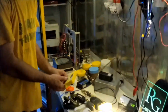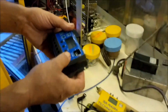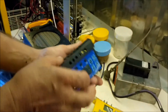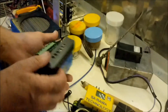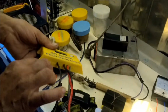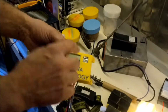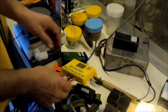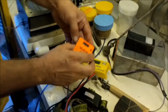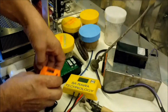One problem here is that the humidity destroys electronics, and there's thousands of little ants that get into them through the tiniest openings, and the screws rust. So with ours, we solder the wires directly to the circuit board. It is unsealed, and we seal around the USBs inside, and there will be plugs for the USBs too. And this is just a small control box for temperature control, complete with push buttons.